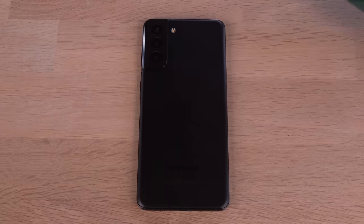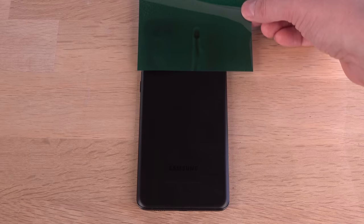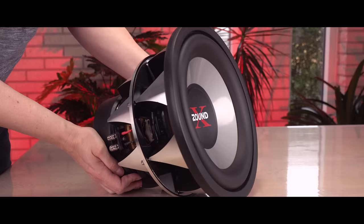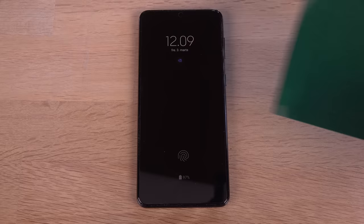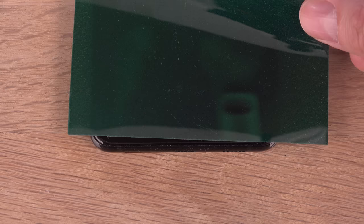What I can't remove are the magnets in the phone's speakers. At least they also look shielded. No surprise, since all speaker magnets are at least half potted. Shielded speakers are fully potted. More details on speaker magnets in the video where I put a monster magnet near a subwoofer. Having magnets stuck near a magnetism sensor is far from ideal. But being shielded and static in relation to the sensor, I guess they compensated the readout from it.